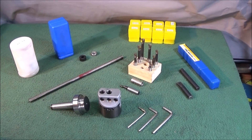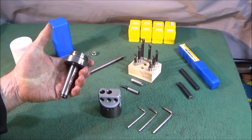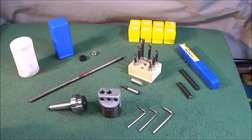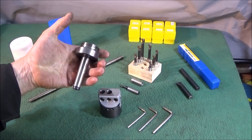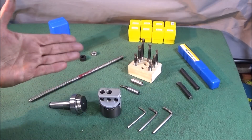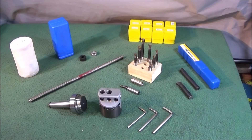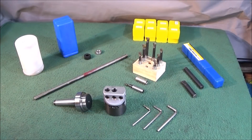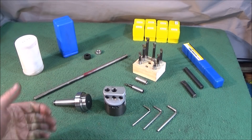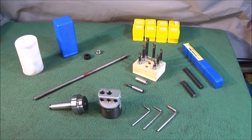I have some excellent new tools through from Banggood — this 50 millimeter boring head with the MT2 taper adapter. I'm going to use this boring head on both my Chinese mini lathe and the Myford ML7. The MT2 taper fits the Myford ML7 spindle. I'm waiting to get the MT3 taper so I can use it on the Chinese mini lathe. I've also got my ER32 collet from Banggood and will do a review on those later on the Chinese mini lathe, but this evening I want to show how this boring head works on the Myford ML7.